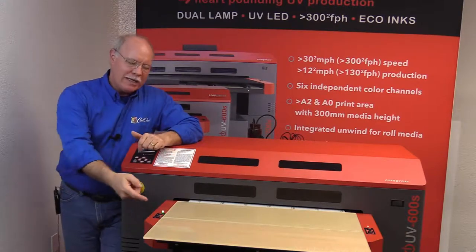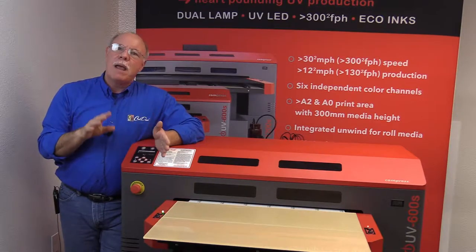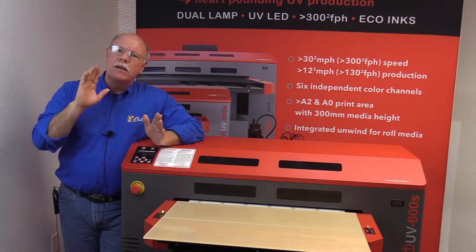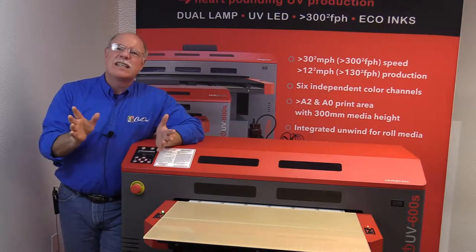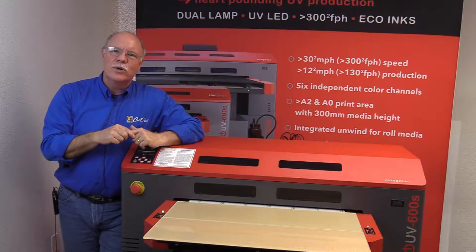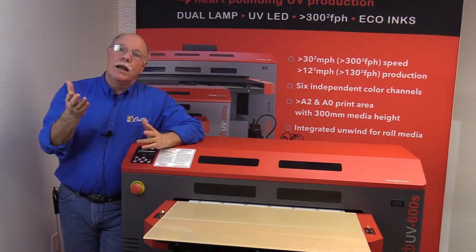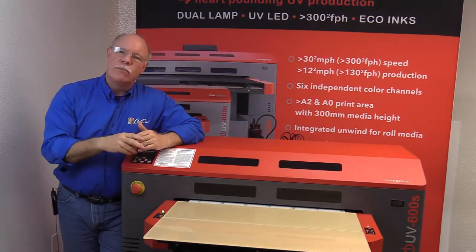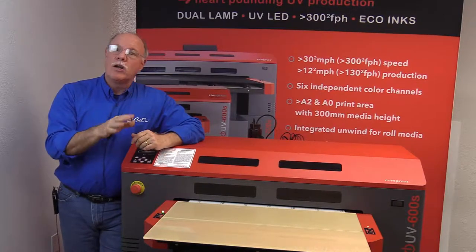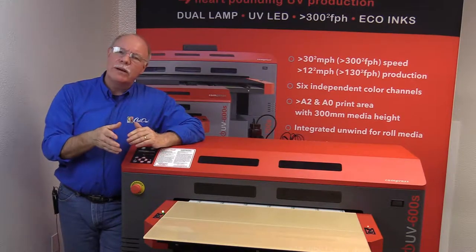Did some rough numbers on it before we came in here — it's about $10 for each of these sheets. I actually have two sheets of clear acrylic here. These are going to be mounted in our media room, kind of like a sound stage where we do podcasts, live webinars, and demos. The signs were getting old, so we decided to use a cool new machine. We're going to front print these because they're going to be front-lighted. If we back print them, we'd get glare from the front and you wouldn't be able to see them as well. So we're going to front print with a white underbase underneath the logos, then print the color on top.